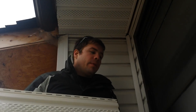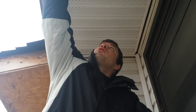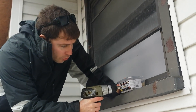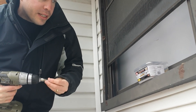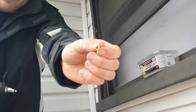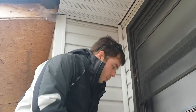See how much I can shift it? That's what would happen if you didn't screw in on this side. Make sure you pull all your nails out ahead of time so you can go down your line. You want to use exterior screws. I got high-performance exterior screws with a lifetime guarantee against rust. I wanted white but they didn't have white - they had tan. I got them because they have a Torx head instead of Phillips, because you burn Phillips heads up all the time.